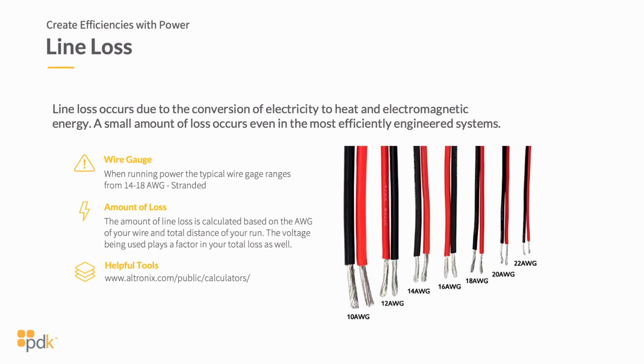So what happens is I get into a project, I decide, well, I've got some 22 gauge wire on my truck, so I'm just going to take that 22 gauge wire. I'm going to run 500 feet. I don't test the wire at the end and realize that I've got line loss or attenuation in the line. And after a while, all of a sudden my hardware, because of being underpowered, I'm running into problems because I've underpowered it for a substantial amount of time. Now again, it might be enough power to keep your hardware running, but as that strike functions and as a mag lock turns on and off, those voltage spikes and losses could really cause some problems, and eventually you're going to end up replacing that panel and/or the hardware at the door.